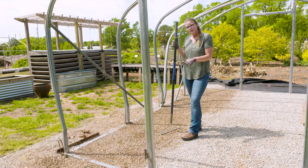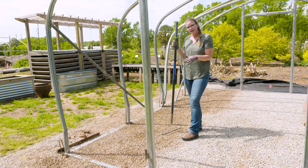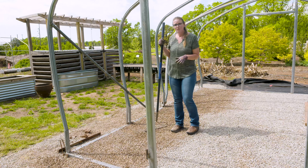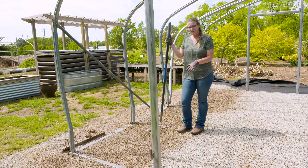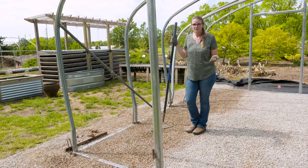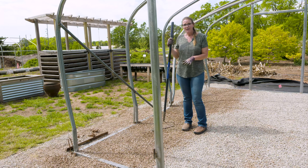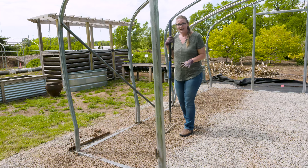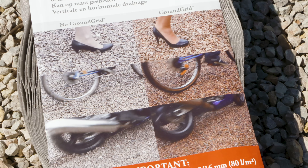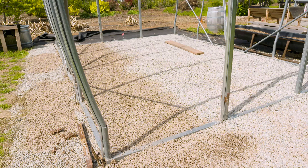You can see a color difference in the gravel here — that's simply because the new gravel is wet, and once it dries it will match just fine. You'll need to let it settle a bit, and there will be some settling over time, so you may need to come back with a little more gravel as it weathers. If you want something more decorative, at this point you could top dress it with another inch of a more decorative material. Overall, this provides a really nice, stable foundation for walking, setting tables, benches, or anything else.